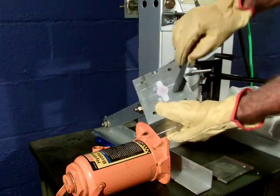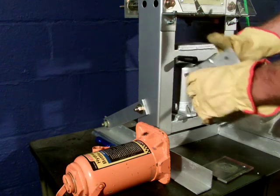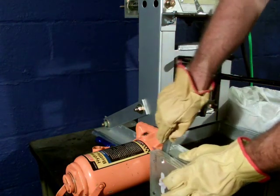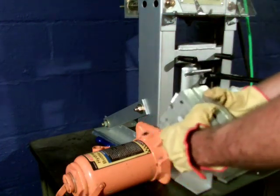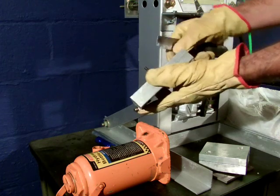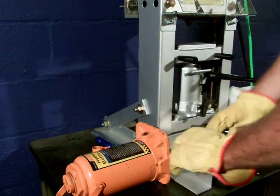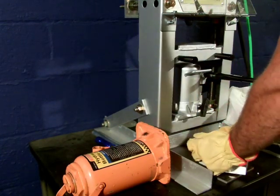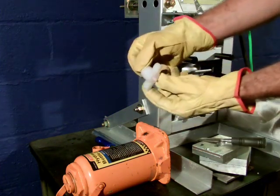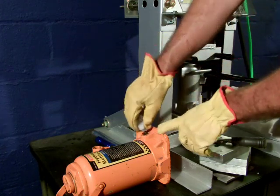And there's the top part of the handle you can see right here, and you'll see how the bottom looks like in a second. And this is the bottom, so it's actually a four-piece mold. Then you just push it out like this. And there you have your final product — an over-molded handle — and it readily goes back into the jack like this.